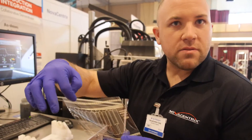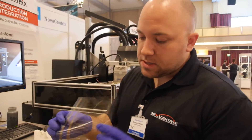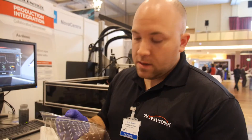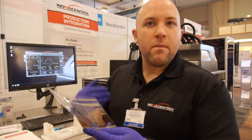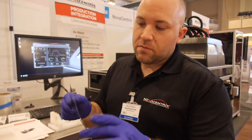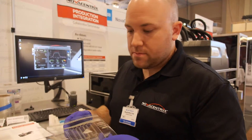Because when you touch it, there's no moving parts for the switch — so it's cheap. This part is less than a fraction of a penny. In this case you get 12 very large electrodes. A penny is one US cent, and this is even less than that — it's just a little piece of plastic with a couple hundred nanometers of silver ink placed on top. So this is printed electronics.